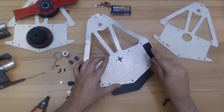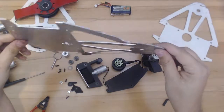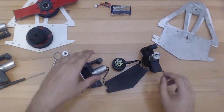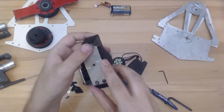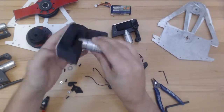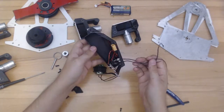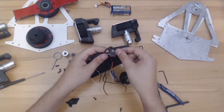This panel is pretty darn mangled. During the rumble, I took some damage right away, and unfortunately it caused me to stop spinning. I took a direct hit from one of the egg beaters on my weapon belt. It didn't break the belt, but it broke it most of the way through, and it folded underneath the brushless motor hub and jammed. With the belt off the track and halfway broken, it jammed up my whole weapon assembly and I didn't spin, which made me vulnerable to the spinners because the thinner sections are usually protected by the spinning bar of death in the front of the robot. I also kind of deliberately fed myself into it a couple of times to try and get them to go flying. I took some pretty good damage there.